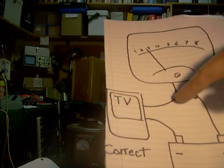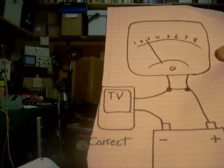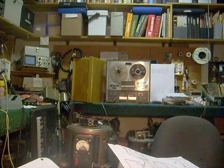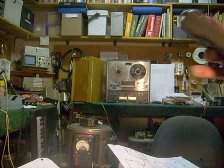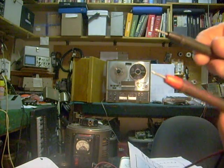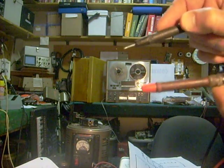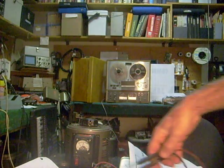This line here actually represents the shunt of the amp meter. It's important to understand this because if you go to use your amp meter with the probe plugged into the amperage function, you have the equivalent of a short circuit between the probes. So if you're checking a particular circuit, you might blow something out. Anyway, I hope I didn't confuse you with that last explanation.